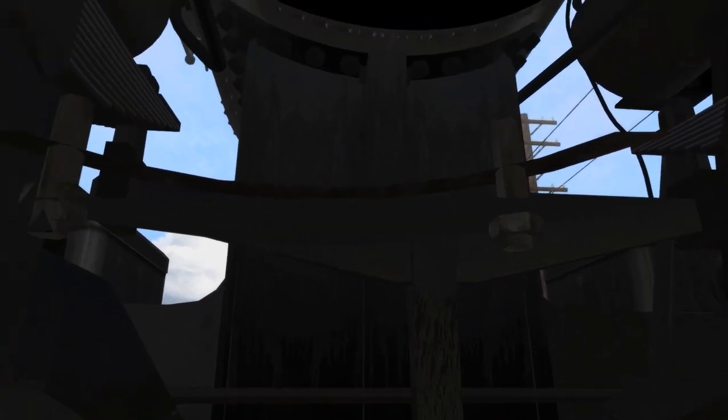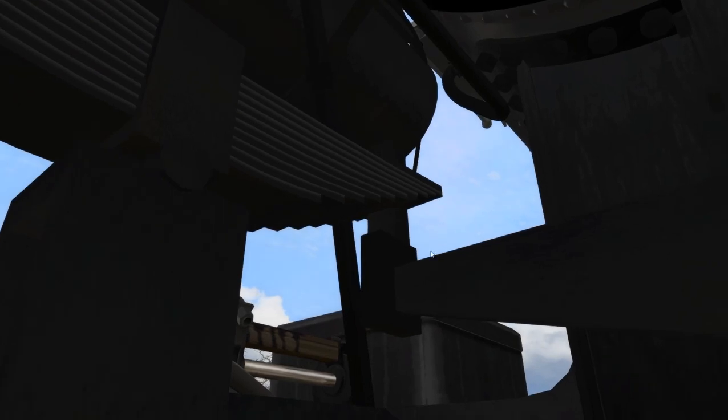So, the front truck, and excuse me for taking so long to do this, because I don't remember if I did it with the 844 or not, but the front truck has got its own suspension up there, as you can see, and what it does is it raises and lowers this bar, and it can kind of go side to side, but you see how this bar is hooked up to the spring hanger on the front driver. So as this bar goes up and down, it puts pressure on this spring. And as this spring pivots on this rocker right here, it makes this spring hanger go up and down. And then that distributes the weight that the pilot truck is carrying throughout the drivers.